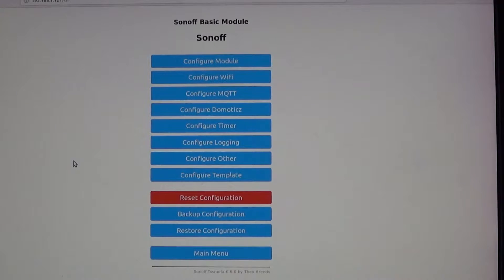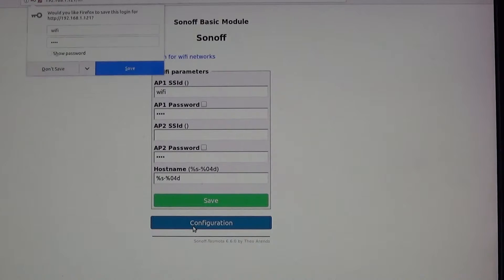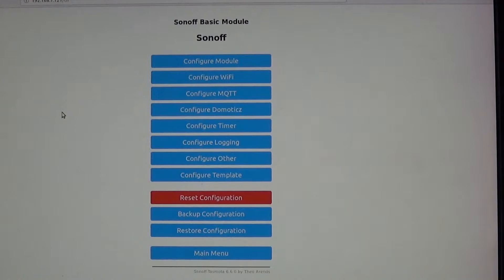Normally you would access this through your cell phone. Open up your cell phone and look for the access point — you'd see something saying Sonoff or similar. Connect to it, then go to your WiFi settings and type in your SSID and SSID password, then hit save. It should reboot and connect to that access point, putting it on your network.